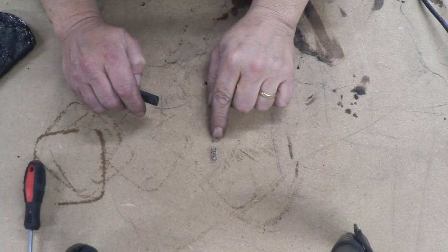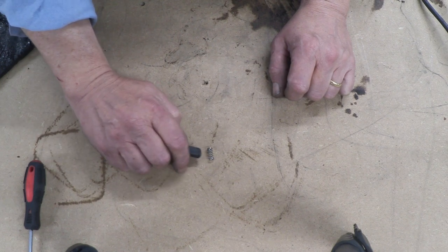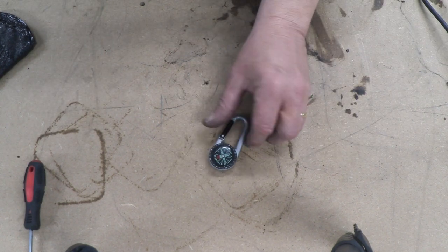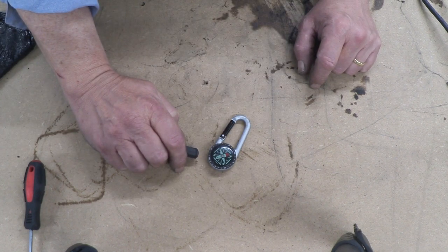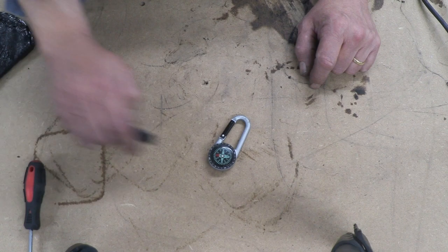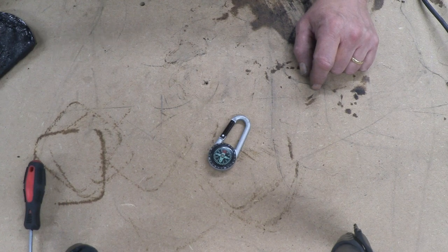This is a magnetiser because it passes DC current. If you want to demagnetise you need to flip it between DC and AC — just put a switch in that takes out the diode, making it a magnetiser and demagnetiser. Here's our spring, here's our magnetised lump of plastic, and we can deflect that spring — it's a much stronger reaction than stroke magnetism. If I drag the compass in, we can see a strong compass deflection using our magnetised bit of plastic.